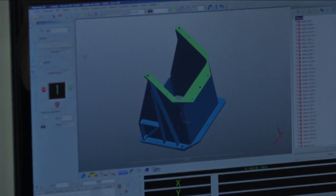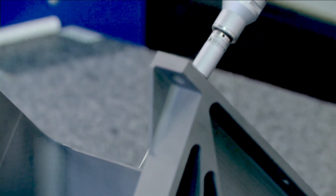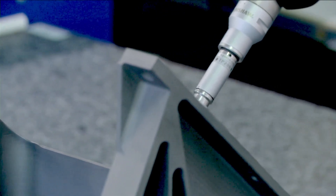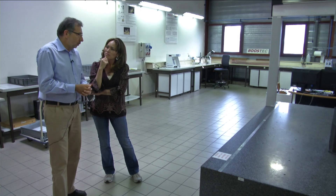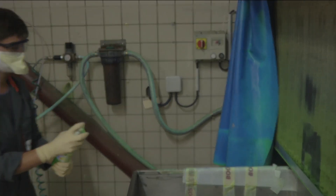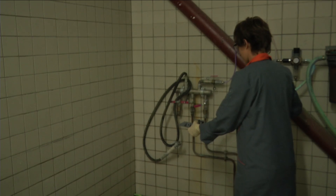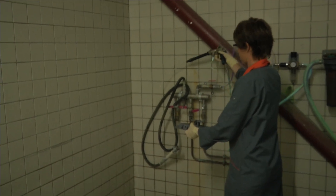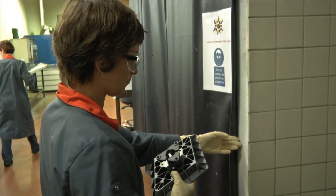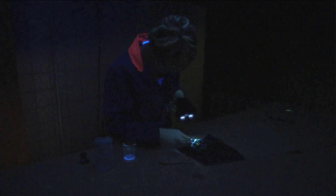He's preparing the measurement of this part with a coordinate measuring machine — he will measure the flatness of this area, precise in the range of a few micrometers. In one millimeter, you have 1,000 micrometers. Here is a non-destructive inspection of the part: we first spray the dye penetrant, then rinse it off, then dry it, and inspect it in a dark room under UV light. If there are cracks in the part, we are able to see them with this technique.